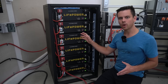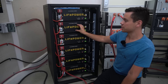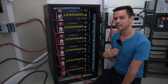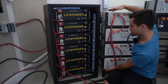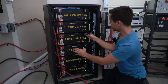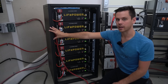The price is incredible, especially for what's inside. The cells are the same as other server rack batteries, and they have high-quality DC-rated components. I like that there's no screen — I just use a clamp meter to make sure every battery is feeding in and out of the system. The form factor is fantastic: we've got 30 kilowatt hours right here. Installation is very easy — you slide the batteries in, connect the leads to the bus bars, then connect your system with cables to the bus bars. I really like this server rack.